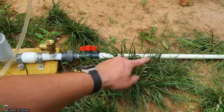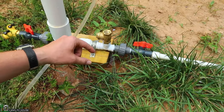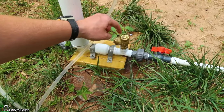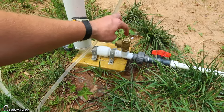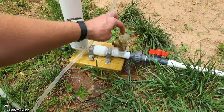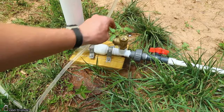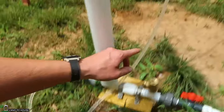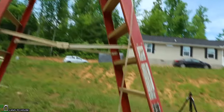What's happening is water comes down this drive pipe, and when this valve closes, it creates a pressure wave that's shot back up the drive pipe but also into the inline valve. So it will build pressure in the pressure tank, and whenever that pressure is great enough, it will start cycling on its own. There we go — and I have the delivery pipe side open. This tube comes around, goes way up this 12-foot ladder, and is pouring out at the top. This three-foot drop from my source is able to pump water up to about 20 feet.